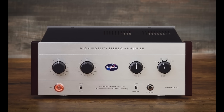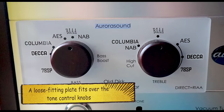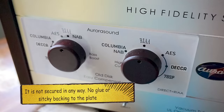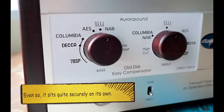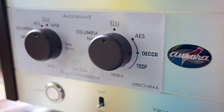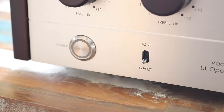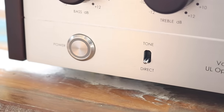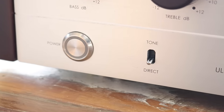What I do like about the tone control knobs is when they are not tone control knobs — that is, when using the internal phono amplifier, they act as a sort of alternative EQ suite of curves for older vinyl pressings, pre-RIAA you might say. This is an excellent addition and in my experience unique to configure it in this manner. Aurora Sound even provides a plate that you can add to select the EQ for you. There is a toggle switch to allow you to access the tone controls or bypass them altogether and go direct through the amplifier, and I kept this direct option on throughout the review.